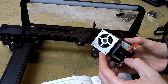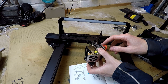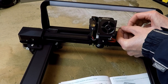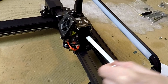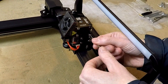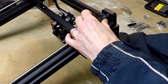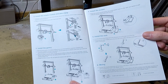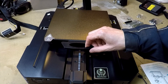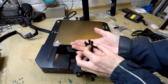This is the nozzle kit, with a little cooling fan inbuilt into it and a stepper motor for the feed. There are about five bolt holes which are used to attach the nozzle kit to the gantry — fairly easy job just to screw them in using the allen key provided. This little plastic bit is the guide for the cable ribbon. Setting out the chassis module on the table, the first thing is to check that the table itself is securely fitted, because it can be adjusted to improve the tightness.